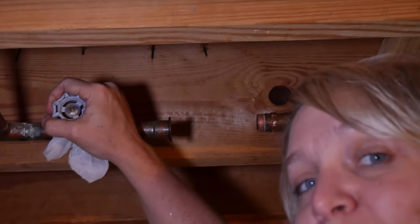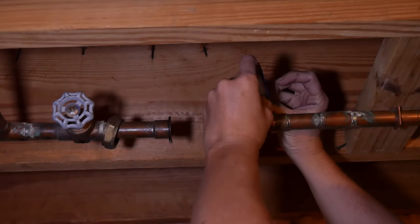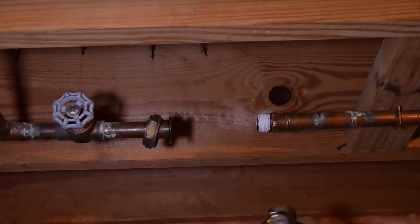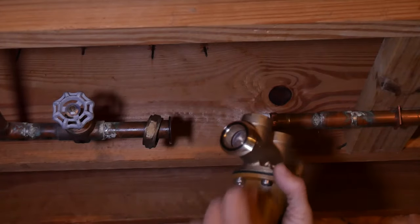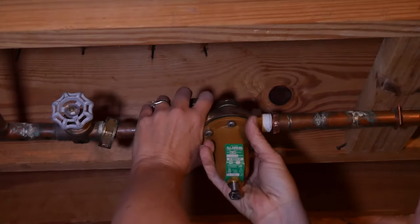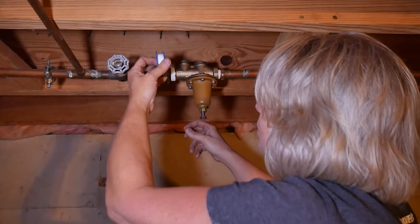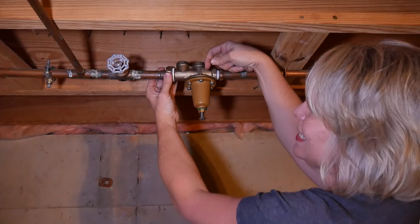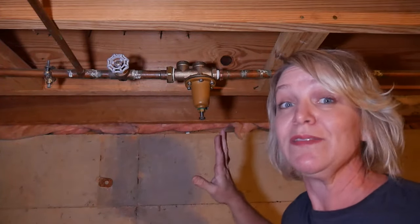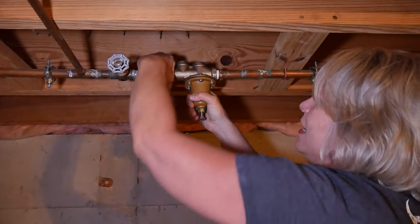Even though I tightened it as much as I could by hand it was still dripping. Now I'm going to take some Teflon tape and put it around the threads in the direction that I will also be turning it, so that they don't come loose as I turn it. I'm going to take off the new fittings and just reuse the old fittings that are already on here, making sure I also keep the rubber ring from the new one intact. You'll notice I've got this thing pointing down instead of up — apparently it doesn't actually matter which direction it is, but if anybody knows differently please comment below. That is as tight as I can get this sucker, so I'm going to go ahead and tighten it up as much as I can.